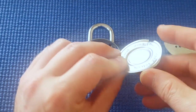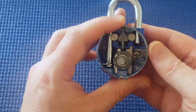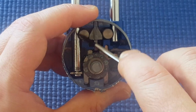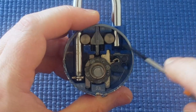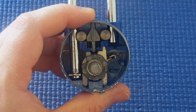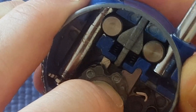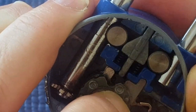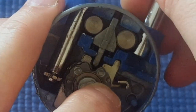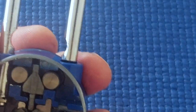Just something extra — I managed to pop the back plate off. It was quite thin, but the next plate was quite thick and took quite a job to pop off; I had to lever it off. You can see here it's full of metal, and these cylindrical ball bearing things sit in the recesses of the shackle and stop it opening up. So there's no way this is going to be shimmed. These will only go together if this goes down, which only happens if the gaps in the dials are lined up. I'm going to line up those two — looking for that last gap. Now the gaps are lined up, they can go down, those two metal cylindrical things go together, and the lock opens up.